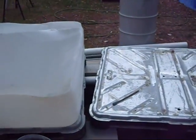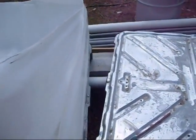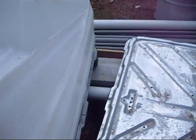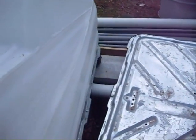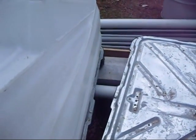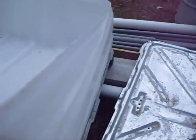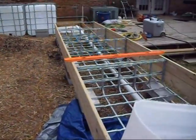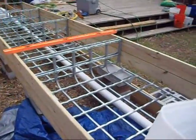You can see the drain pipe. I'm going to try using a three-inch drain. I'm going to come out of all the grow beds with a one-inch auto siphon drain, bore holes into the top of the three-inch, have them drop down in there, and let that feed the sump. That way if I have multiple beds draining at one time, the three-inch should be able to handle it.